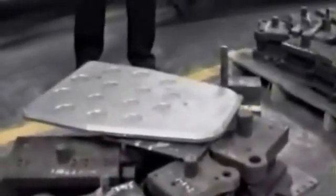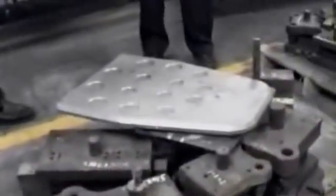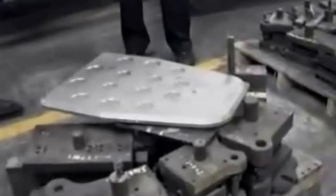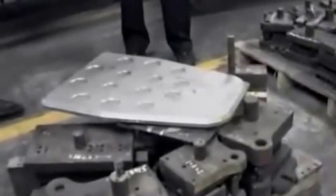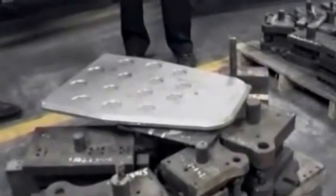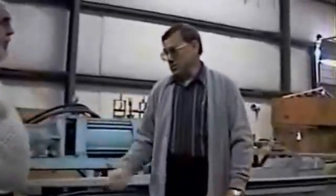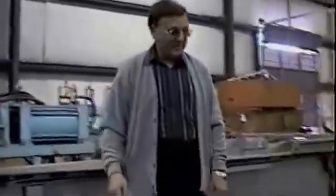And that expander, by the way, there's only one, expands all the spars, starting with the Yankee all the way to the 5B. That was the beauty of the design of the aircraft. When it was started off as a two-place aircraft and then became a four-place, all engineering did, you used as many parts as possible from the two-place on the four-place. Even the wings, you just added another panel to it, they shoved it on, put pins through, you know.